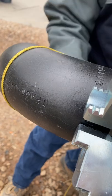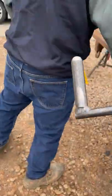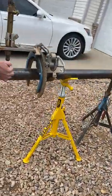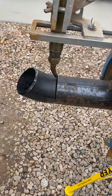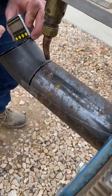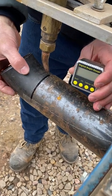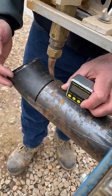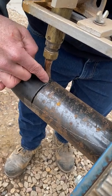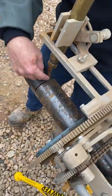There's your mark. I would just rough cut it with a torch and leave it a little bit long. Then the next step is to set that on here, take a mag level — these are handy because you can zero them out — and make sure that's the exact angle, 37 degrees, that you want. Then I would tack it, tweak it around, put a wedge in there, get it exactly at the angle you want. Make sure you've got a tack at the top but don't pull that tack out. Start on one side of it and back-bubble all the way around and finish with that tack.